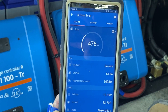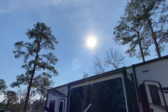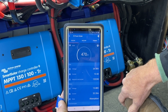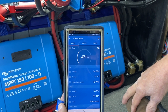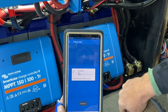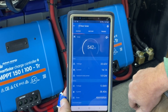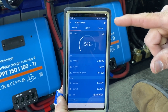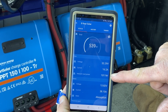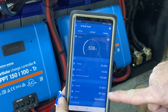It's drawing in 475 watts and will slowly build up to its maximum. We are in northern Florida — it's about 2 o'clock in the afternoon. Out of 1,300 watts, with the angle of the sun right now, we're pulling in 470, so that's about 40% — which is not terrible. The combined network total power from both systems is displaying the total watts from the roof: 1,012 watts total, which is about 70 amps.